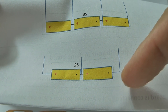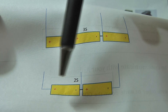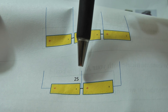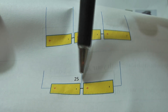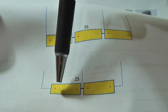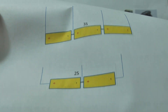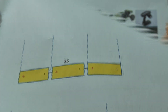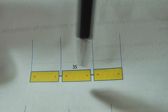This is a 2S battery. We have here 2 cells and 2 wires — negative and positive. And we have one wire between both cells. That wire acts as the positive of one battery and the negative of the other battery. The same wire is connected between them. So we have 3 wires for 2 cells. For a 3S battery, we have 4 wires for 3 cells.